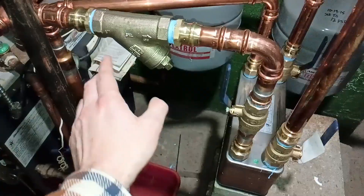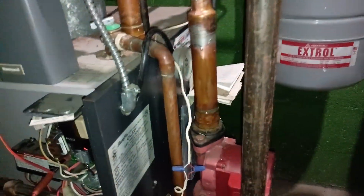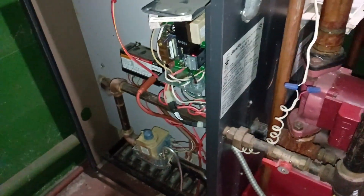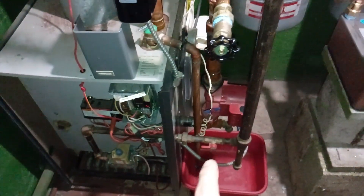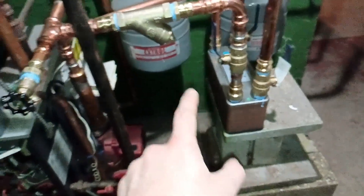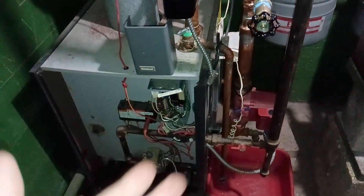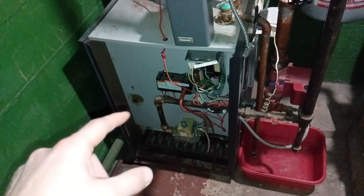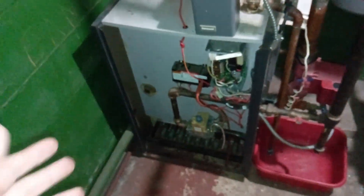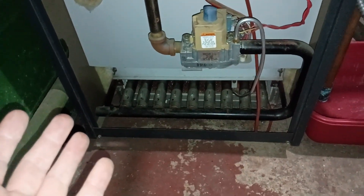You can get the directionality: water is going down, across, down here to the pump, and the pump is pushing the water into the existing boiler. I've got the face plate off so we can look a little deeper. The first thing that happens when the house calls for heat is that pump turns on, pulling hot water through the heat exchanger, heating it up. What we really want is for the existing boiler to sense that the water is already at temperature and not turn on the firing mechanism — we don't want the damper to open or any of that to take place.